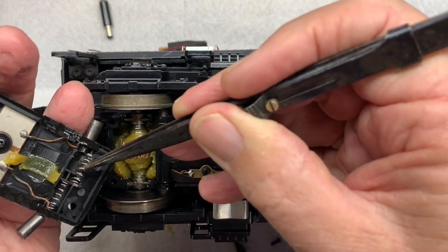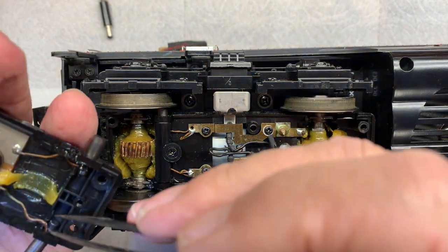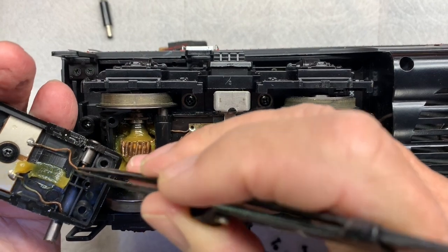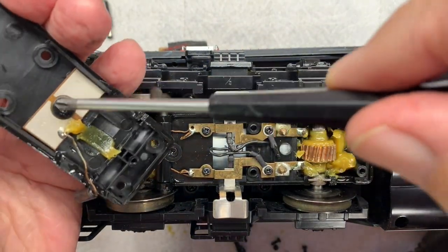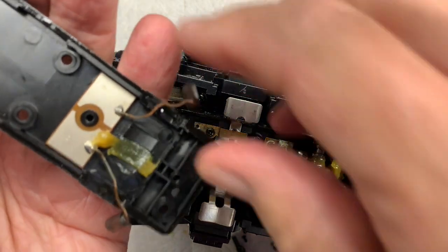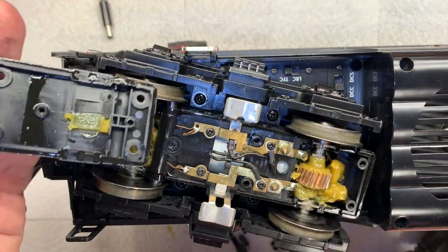All right, very carefully remove the spring. And there's little spacers that go between the spring and the pickup wire that holds these. And take the entire plunger out here. And take the screw out. And then take this pickup, the wires, the plungers, these screws, the guards, and everything, and essentially discard them. Do the same thing with the other side.